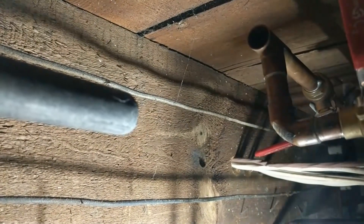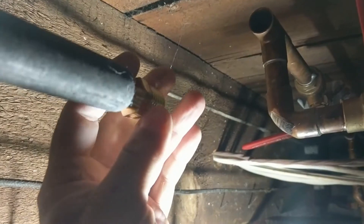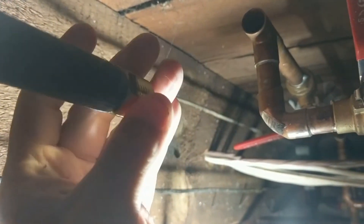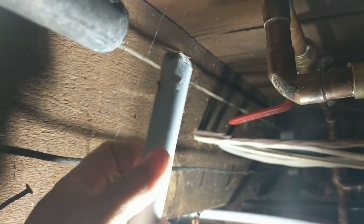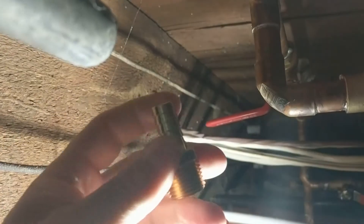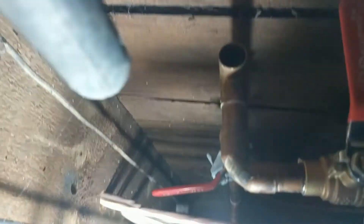So what I'm going to do, I hope, is I've got this half-inch male-to-hose barb. I'm going to stick that in there. It fits with some space, and I've got this plumber's epoxy — this is two-piece epoxy, you cut a piece off if you need it. I'm going to take that and wrap it all around this hose barb, jam it in there, and let it cure, and hopefully then I will be able to just use standard fittings on here to join it up to there with more standard fittings.